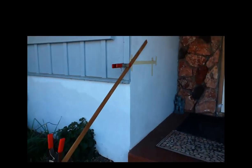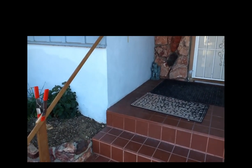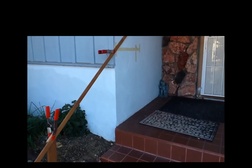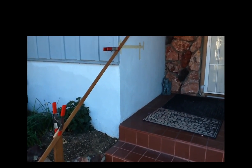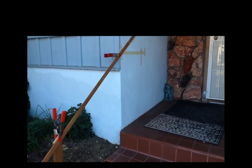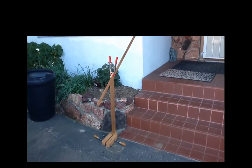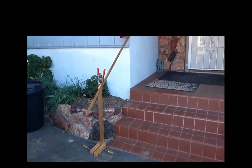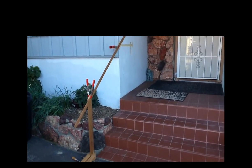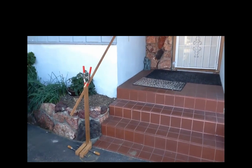I'll dig it out, and at the bottom of that galvanized pipe I'm going to drill a hole through it and put a bolt — nut it in at both ends so the bolt is sticking out both sides of that pipe. Once it's in the concrete it won't move, won't spin or turn around — that's all I need. This is it, short and sweet. I hope it's clear enough. The average guy can do this, it's not that hard. Simple rail — the layout is the most important thing. I've got the same layout over here on both sides, taped at the heights.